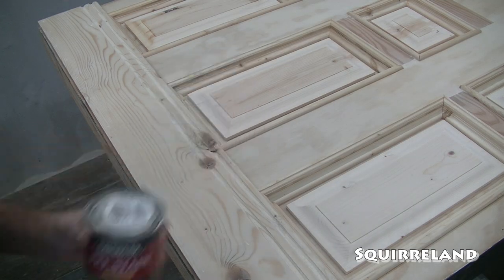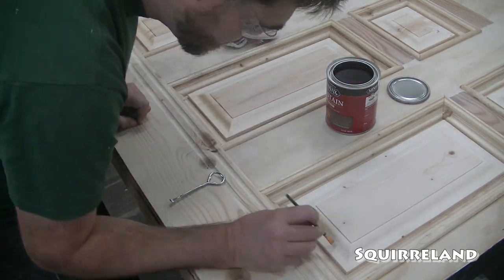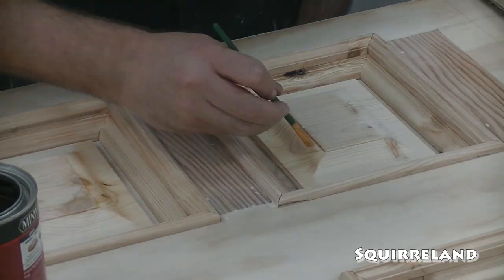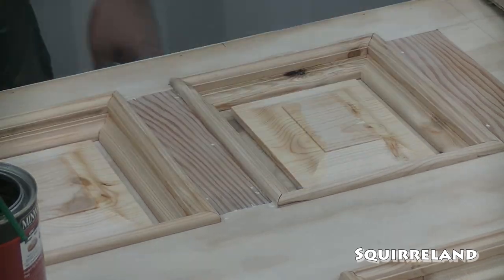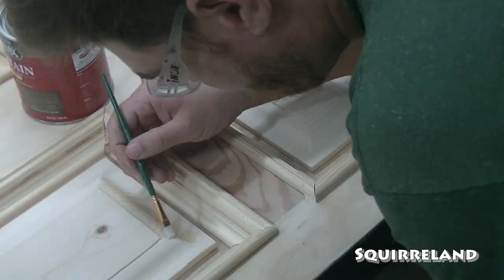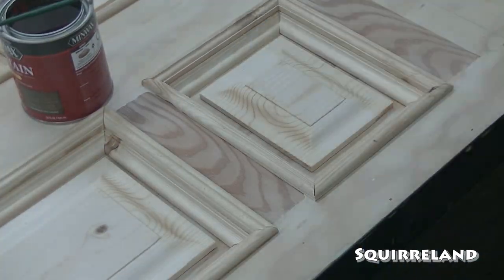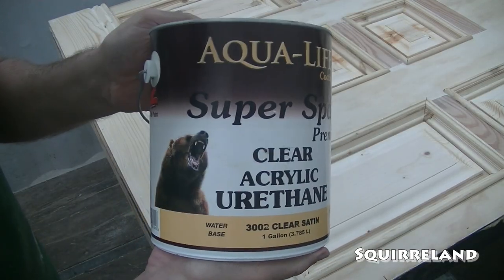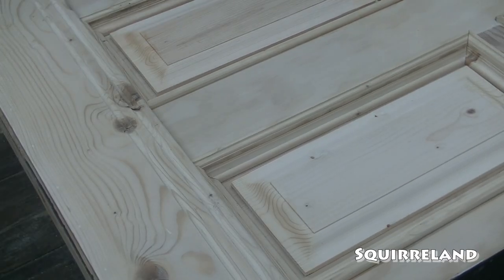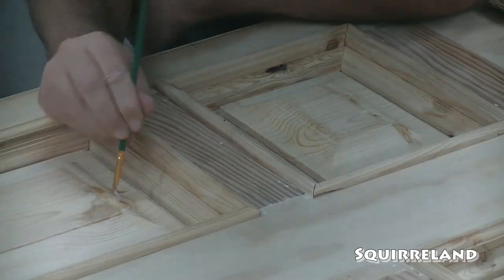The first step I did to help the ends of these decorative boards look better with the wood stain was to carefully brush in a coat of pre-stain wood conditioner, but only into the end grain of these boards and nowhere else. After I let the wood conditioner dry, I moved on to doing the same thing with a single coat of clear satin acrylic urethane. Once again, I carefully brushed it into only the end grain of the decorative boards. I didn't need to apply it anywhere else on the panel because all of the other end grains were covered.